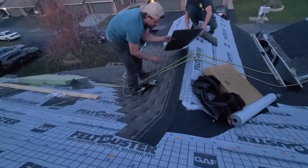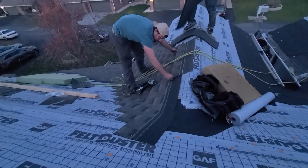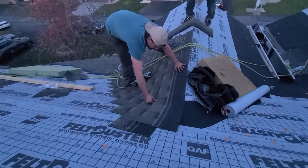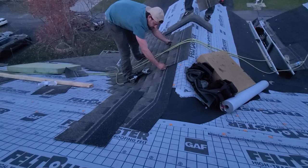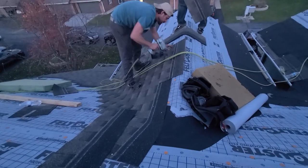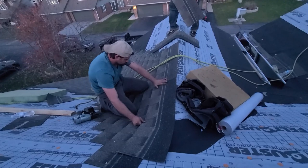What I'm talking about, why I dropped that back. Look, I'm gonna drop this back just a little bit. Give me another shingle, boy cub. It wasn't super in the valley, so I want to make sure that it's got enough. Yeah, it's fine. Come over just a smidgen more. Now again, I'm only lining up right off the shingle. It should be straight now.